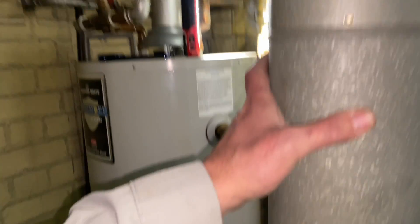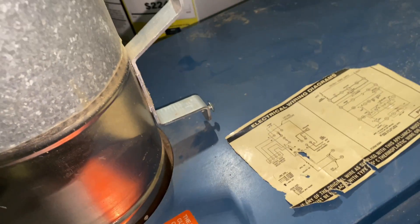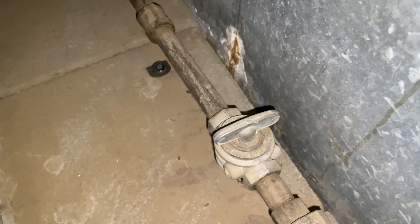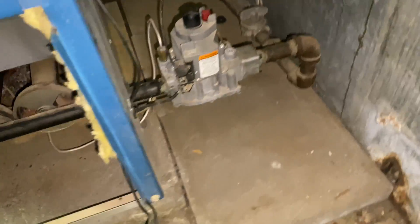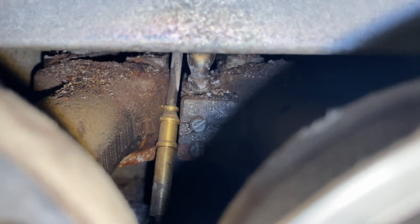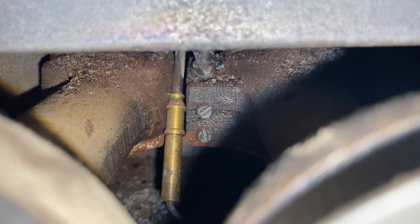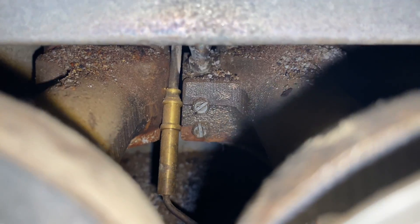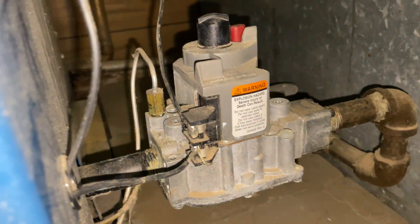These are our flue pipes — looks like five-inch — and this is where our vent damper would normally be. That's our temperature and pressure gauge; right now it's cold and off. Our gas valve is also getting power from the safety circuit, but gas is turned off. What's really interesting is that little thing installed in a weird fashion right there — that is called a thermocouple. Its job is to sit in the pilot flame at the pilot burner assembly and send a small electrical charge to the gas valve, keeping the pilot open.